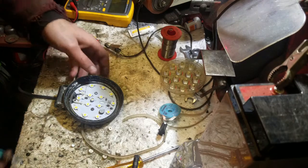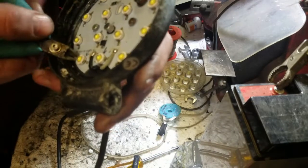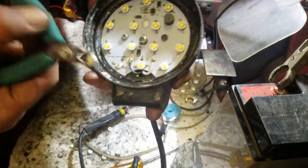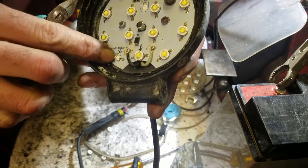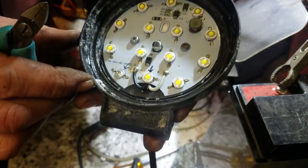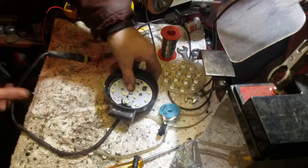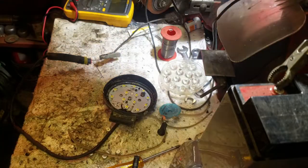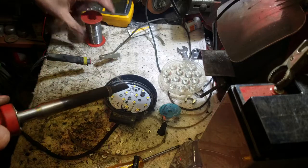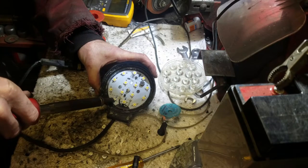The easiest way I've found doing these is to snip the legs first, and then just force the top of the LED off — because this is soldered onto the back for heatsink purposes, so it's really hard to get off in one piece. Let's take that off, get the extractor going. A big soldering iron helps.